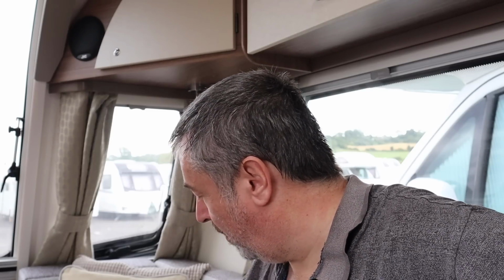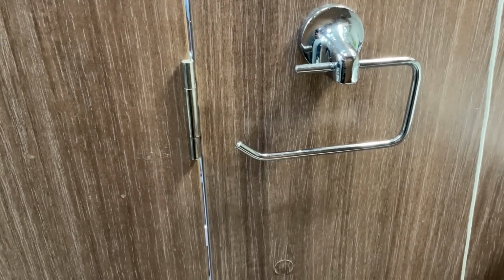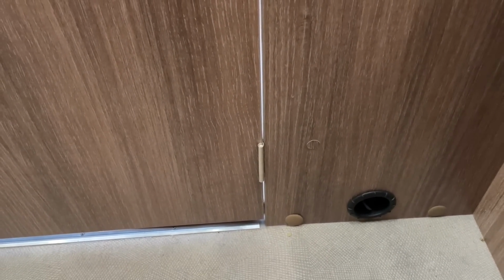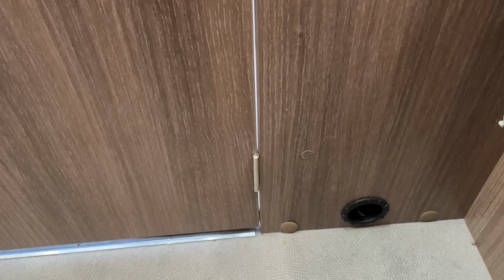So let's measure up the door. Because the strips that they sell it in is 1980mm strips, and I know for a fact our door is not that tall, so I just want to measure up and see how they are. A couple of considerations I need to make sure. I need to make sure I go around that correctly, which shouldn't be a problem, and also I need to make sure I don't interfere with that fixing down the bottom there where the wallboard is actually fixed to the floor. So I need to make sure it's slightly shorter than that.